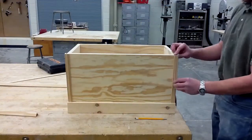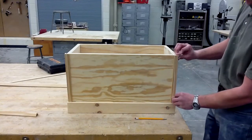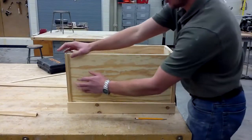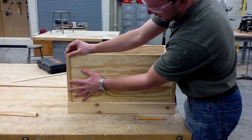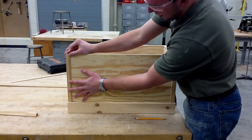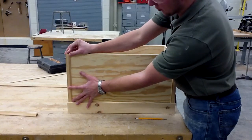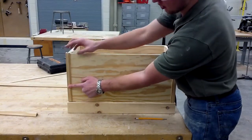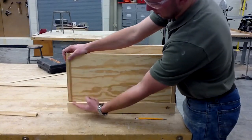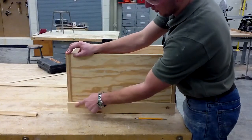What I'm going to do is go ahead and attach this, making sure it's flush. If I cut it just a little bit too short, what I can do is split that difference so it's flush up top and then the gap is a little bit on the bottom too. I don't want the whole gap at the bottom — that would look like poor craftsmanship. So I want to make sure that it's flush and touching the bottom, and if it's not flush up top, split the difference a little bit.